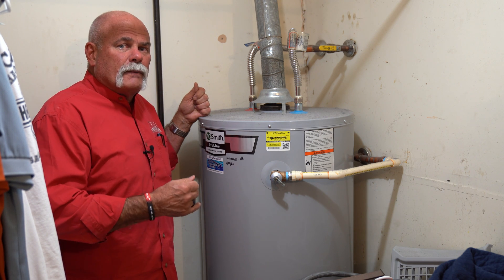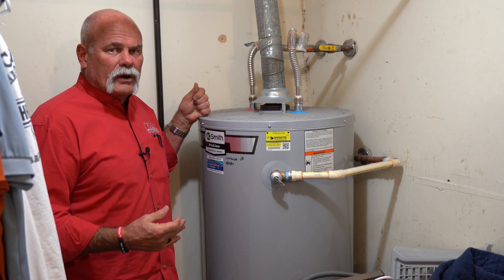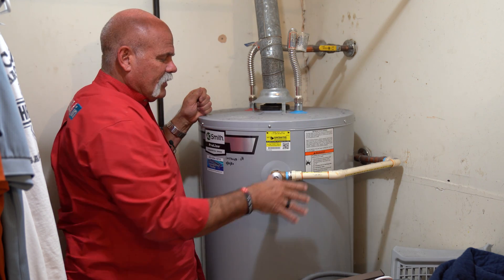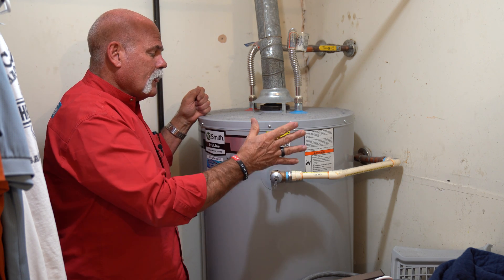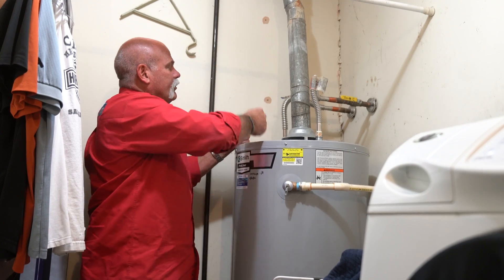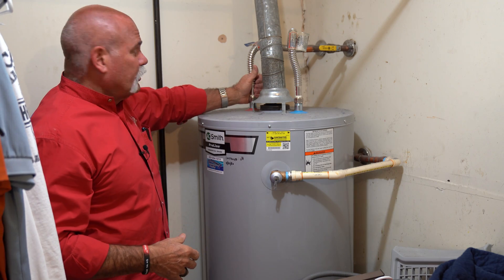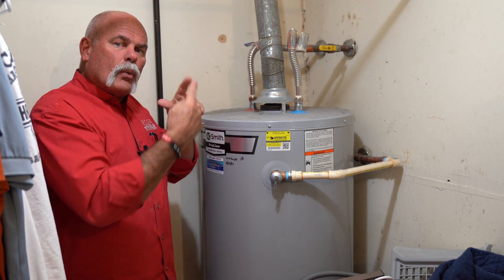Annually is the best time — each year you want to hook up a hose, run it out, get as much sediment as you can out of it, and that's going to help your water heater last longer. If you really want to make it last longer, the anode rod — change it after the first year. Shut the water off up there on the valve, drain the pressure off right here. Get used to cycling this every year anyway. Take the pressure off, undo that rod, pull it out, and put another one in. If you don't have enough room to get that rod all the way out, they do make rods that have breakers in them that actually swivel. If you've got a Bradford White, your hot side is actually your anode rod too — it goes all the way down, and it's drilled at the top so the water line comes out of it.